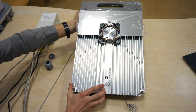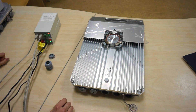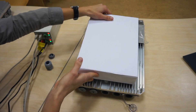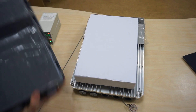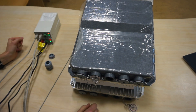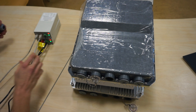So now for the bench test, if you don't have the test kit, don't worry about it. There is an option to use an office paper pack. Place it on top of the unit and place your other Integra E unit on top of it. The office paper pack is sufficient attenuation. So our test kit is now ready to go — we only need to apply the power to both of the Integra E units.